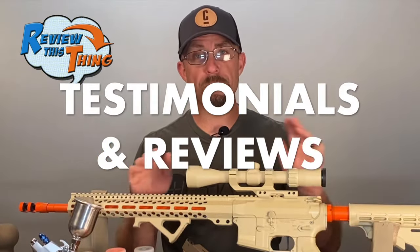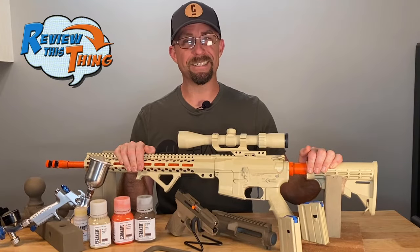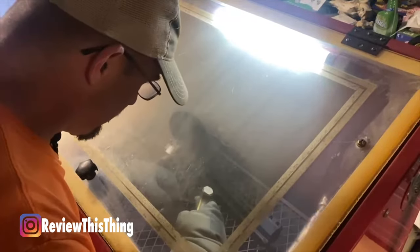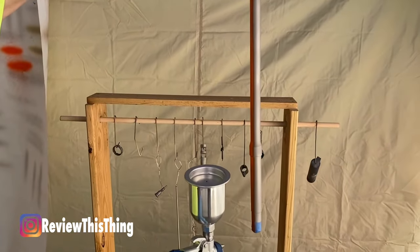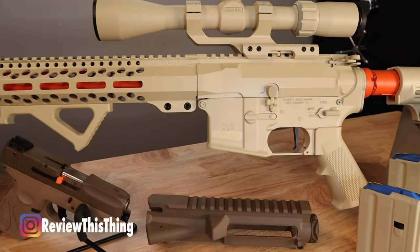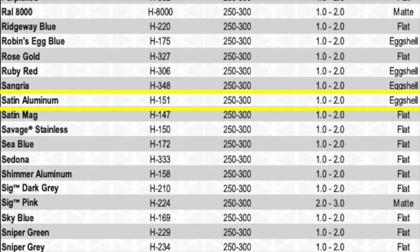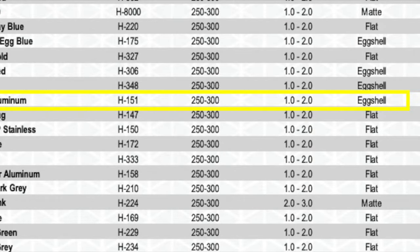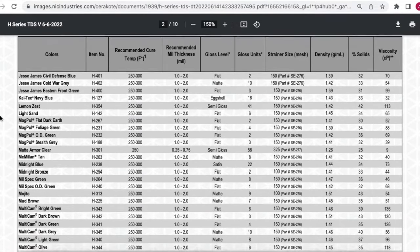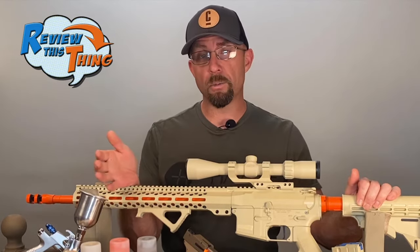On to testimonials and reviews. Overall, the reviews we found across several different websites were very high, but we're going to show you the low ones and the complaints. Some people said this process is tedious and very time consuming — Adrian would highly agree with that, though I thought the process was a lot of fun. Another complaint said that it blistered — I'm not sure exactly what they meant, but ours turned out really well with no blistering. Another review said the satin aluminum color wasn't glossy — check the tech data sheet for that color, because satin aluminum is actually supposed to be eggshell finish, which wouldn't be very glossy. There are several other colors that are high gloss, so check the tech data sheet for whichever color you're working with. A lot of the other negative comments were from people who didn't know what they were buying — they didn't know they'd have to bake it to cure it or understand all that was involved in the process before they bought it.